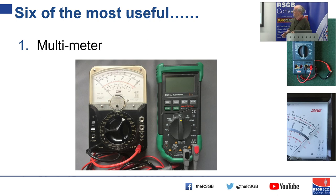The analog multimeter has a big moving coil meter and a knob — what's not to like? I think that analog multimeter cost 69 shillings and sixpence, which is just under £3.50 in new money, translating to about £60 in modern terms. The functionality of the modern DMM compared to the old multimeter is really good value for money. Also, the modern DMM may be susceptible to noise and RF, and the old analog multimeter can be your friend in those circumstances to find out what's really going on.